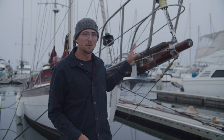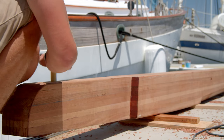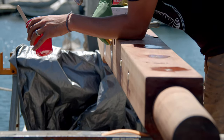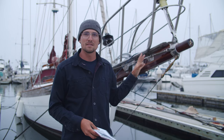Drilling through eight inches of hardwood is a task in and of itself, and then you add in aligning the holes for the pulpit, the iron, and the samson post perfectly. I had to think about even the thickness of the varnish that was going to be put on after. Once all the stressful drilling was over, it was time to move on to my last step: installing G10 tubes into all of the holes. I did this because I wanted no chance for water to get into the bowsprit. Epoxying these tubes in created a barrier between the bare wood and any moisture. It also meant no sealant was necessary for any of the bolts, so Baron can take the bowsprit in and out as many times as he wants without worrying about resealing.